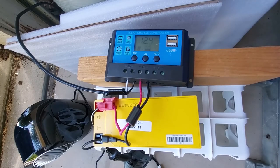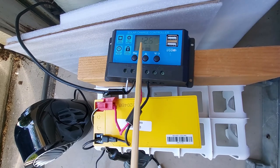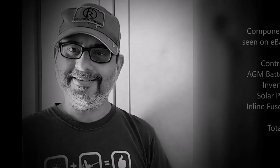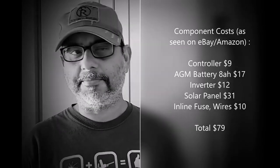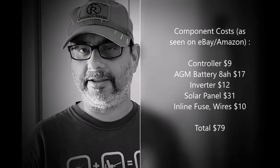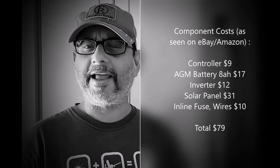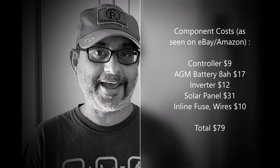It's been about five minutes with the fan running and the voltage is going between 12.4 and 12.7, mostly staying around 12.5 to 12.6 — not bad, doing pretty good. I was expecting worse given the health of my battery, but I'm happy so far. A few takeaways: I'd probably use a better charge controller — a brand name or even an MPPT — just for reliability. I'd also use lithium batteries if I didn't already have one lying around. Maybe I'll try that and do another video. Please leave some feedback and subscribe — thanks!